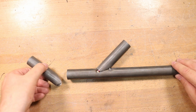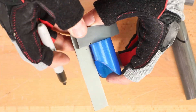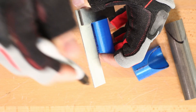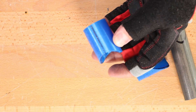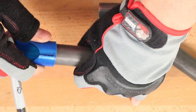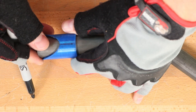To do the other joint, go ahead and take the first angle — which in this case is 45 degrees — and draw a line in the smallest part of the angle. Then on the other side, draw one in the largest part of the angle. Since this one is 90 degrees, it doesn't really matter which side you use. It's important that both of these have the same intersection line. This clocking line that we drew will be really useful for aligning the two cuts.